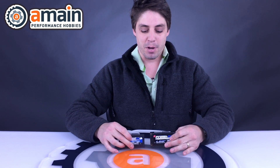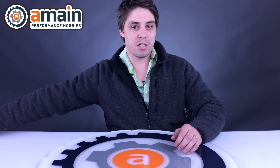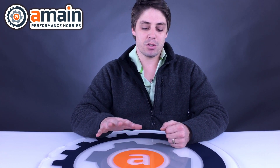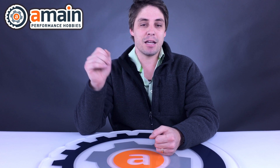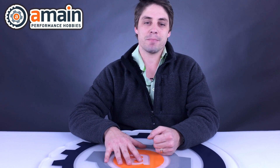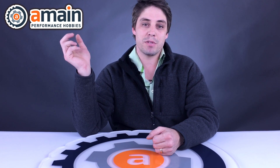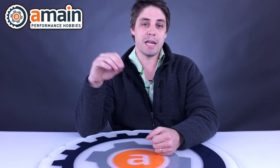So let's have a look at those batteries. I did bring two batteries with us today — two ProTech batteries. These are both LiPo batteries. One is LiHV and the other one is a regular LiPo battery. But before we get to LiPo batteries, which are one of our most commonly used batteries today, I want to start with a very basic battery — the one that comes in many of the ready-to-run vehicles, known as a nickel metal hydride battery, also known as a NiMH battery. We start there with the NiMH battery because it is in the ready-to-run vehicles; you'll see this most commonly with batteries that come included in a kit. So why are those batteries used and not LiPos? They are less volatile than our LiPo batteries, which makes them safer and easier to use and also subjects them to less legislation when being imported from other countries in the kits. I believe this is one of the big reasons why manufacturers still today use nickel metal hydride batteries.